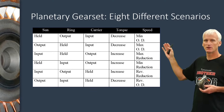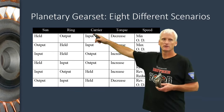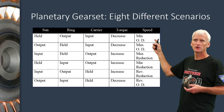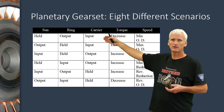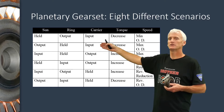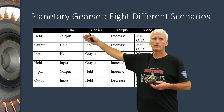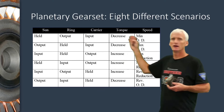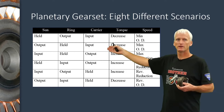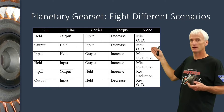Here's a table that lists all those combinations out and we'll use it to figure out gear ratios. Along the top we've got sun gear, ring gear, and carrier, then what happens to torque and speed as it transfers through. If the carrier is the input — the largest gear — we're going to have an overdrive. If I input the carrier and output the ring gear, which is medium-sized, I get a minimum overdrive. If I input the carrier and output the sun gear, largest gear driving the smallest, I get a maximum overdrive.